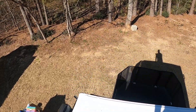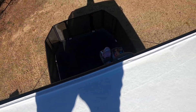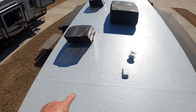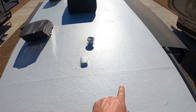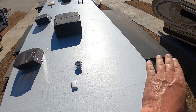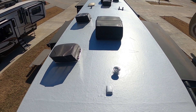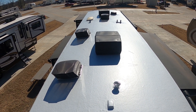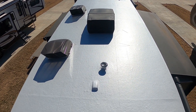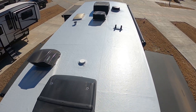They did the same thing here — they extended it beyond the rear cap and it's completely coated. They also did the radiuses. You can see there's a seam right here and a seam right here — that's because they installed their own membrane in a couple different layers, then installed two coats of primer and a final coat. It's been two weeks now and it's pretty solid, kind of rubbery, but it looks pretty good.